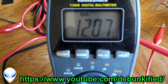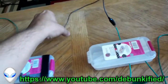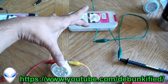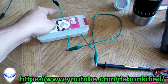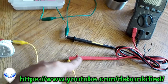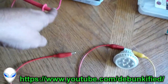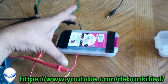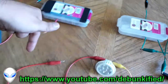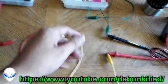We've got 12.07 volts right here. I consider this one whole system — here's one side and here's the other side, so these two things are in series. One side goes to one side of our circuitry, while the other side goes through one side of the meter, the current comes out the other side, and through one side of our load, back to positive. That shows this voltage is powering this entire thing. Current is coming directly out of that voltage source; I have the meter on the load side.